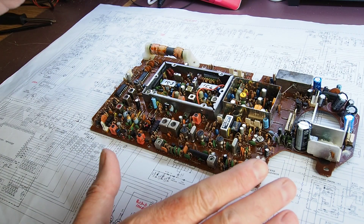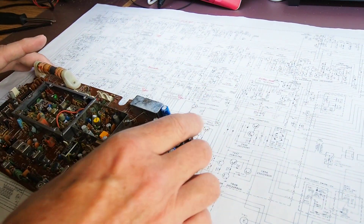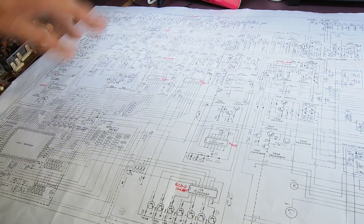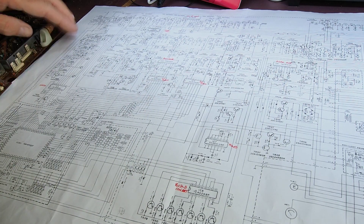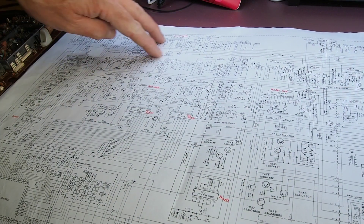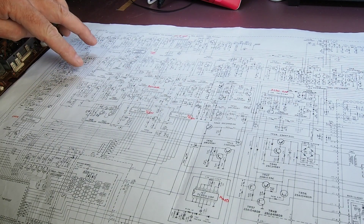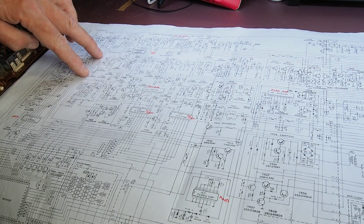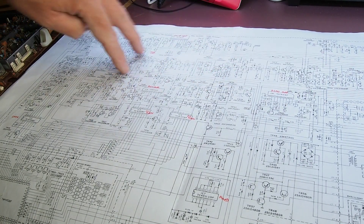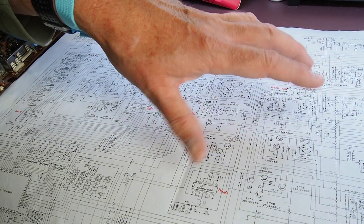The first thing I did was to have a look at the power supply to the various bits of the board. You've got the microprocessor down here and various logic to select the various bands. This is the front end antenna here, then you've got the FM first IF front end here, and the AM and SSB front end — that's the mixer there — and IF and filters, particularly for the sideband, along here, and then audio frequency and various other bits across here.